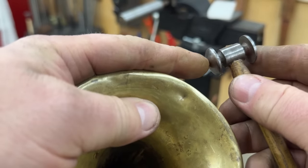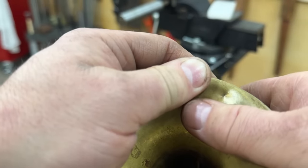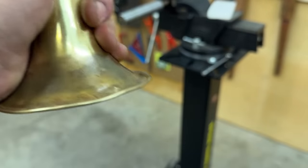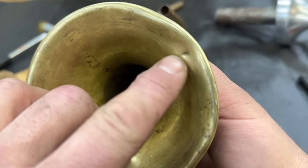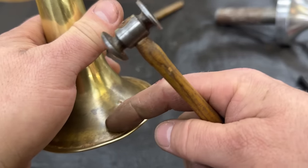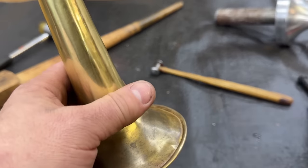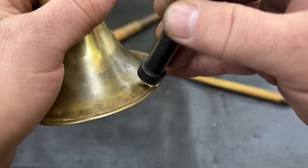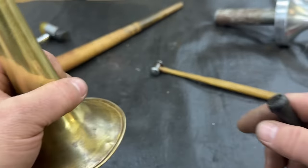We're going to take the backside of a dead hammer and try to push that punch out. Okay, maybe not that. Now what needs to happen is we need to punch out what looks like a BB gun shot. We never hammer on a bell flare — steel against steel — you never hammer it, you're always going to get donkey tracks. So the first thing I'm going to try is this plastic tool punch that I've made before. I'm going to try to rock this in and punch it against the steel form and see if we can get some of that out.